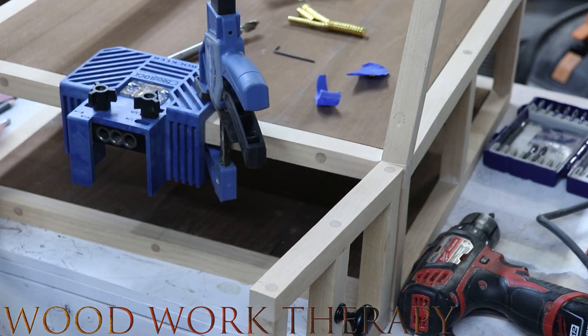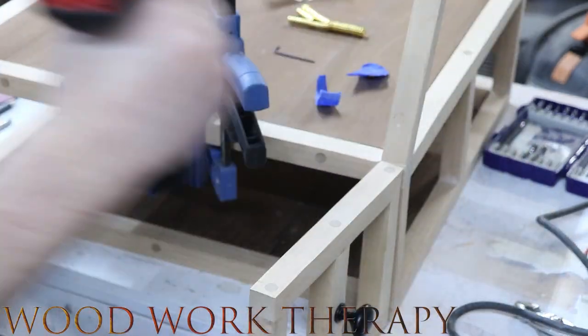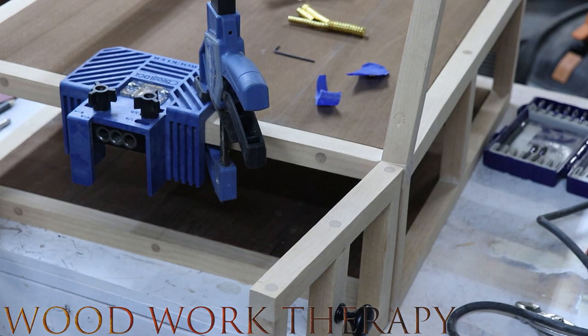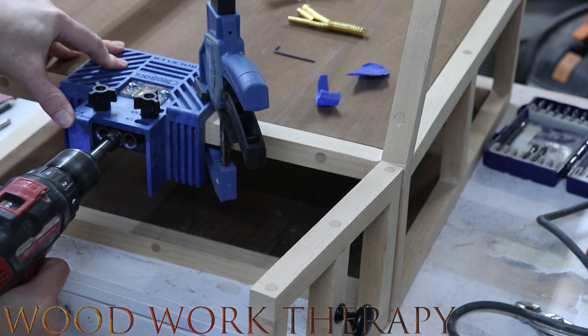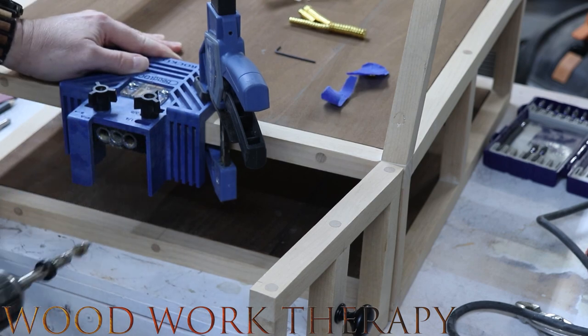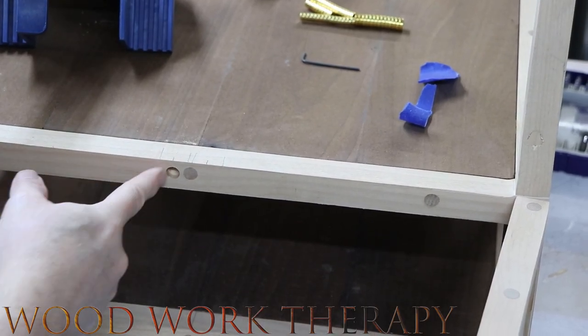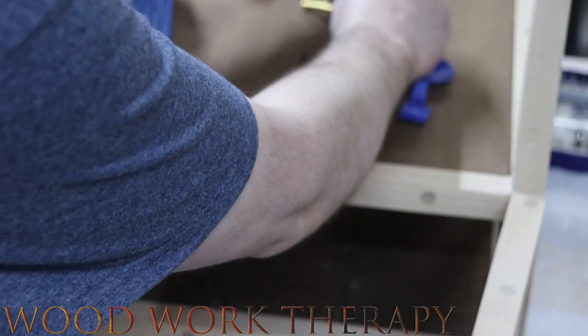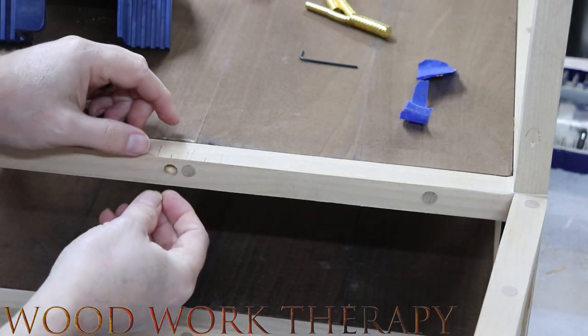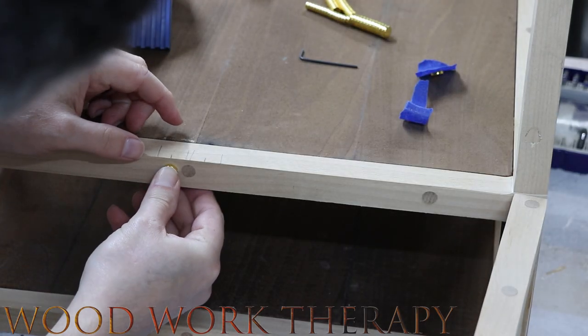So now we're all in there. All we have to do is add our drill bit into our drill, do a quick drill in, throw the magnet in, probably glue that into the back too, and then we're good to go. So let's do this. Okay, so now we have our hole in here, which does not go all the way through, which is what we want. And now all we have to do is take one of our earth magnets, doesn't matter which side, and just push it in there.